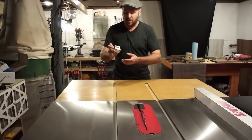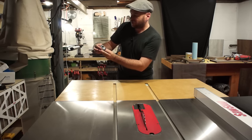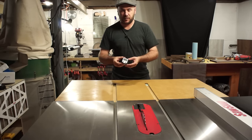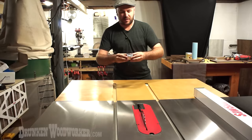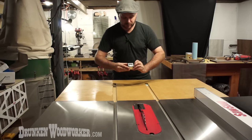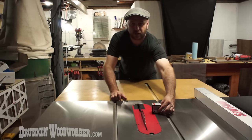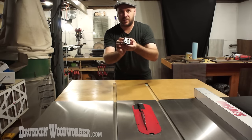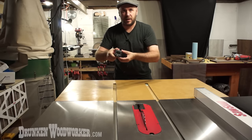Today I just wanted to show off this neat little gadget I got for my table saw. It's the Wixi Digital Angle Gauge. I got it for 30 bucks on Amazon. Basically, you turn it on, set it on your table saw, zero it out, and then attach it to the blade using the magnets on the bottom. Then you can change the angle of your blade to whatever angle you want.